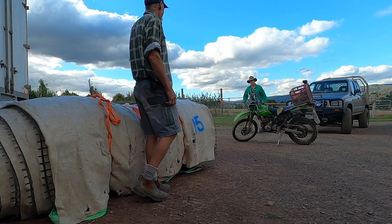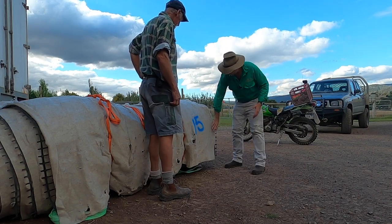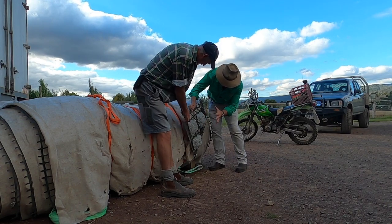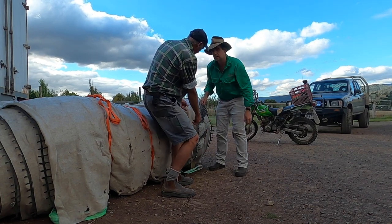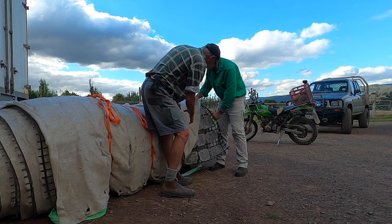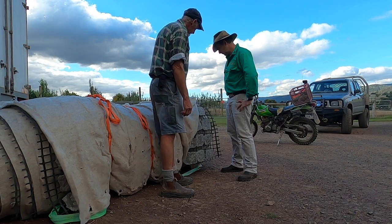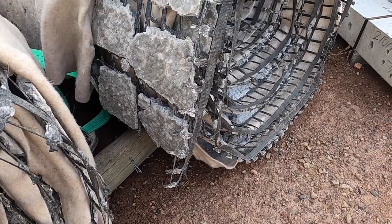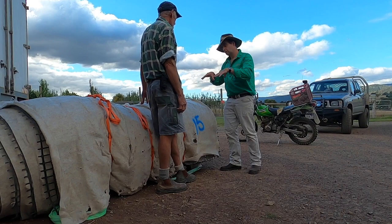I'm a young bloke and I have trouble keeping up with you! So this is the concrete matting, and this is what it looks like. We've got felt on top of a nylon webbing on top of clumps of concrete that have been moulded into it. They tell me this is a biodegradable geomesh or geomatting — the idea being that it's going to act like a fertiliser eventually; it breaks down into a composty type fertiliser for the seed. This goes underneath the matting when it's rolled out, giving a bit more stability at the early stages for the soil until everything stabilises.